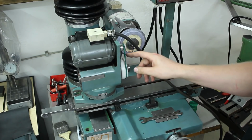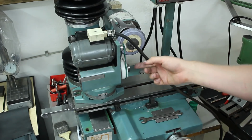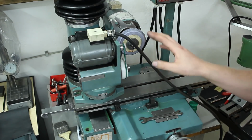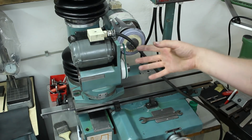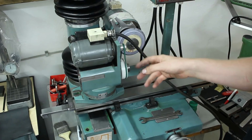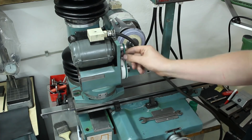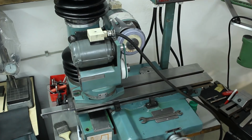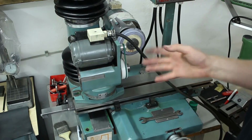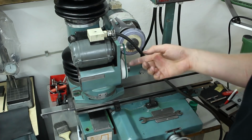Originally there was a set of gears going from the motor to the spindle, and I did not like that. It was relatively noisy, and you could see it on the surface finish of the grind. So I took off all the gears, machined 2 pulleys, and welded some 4mm polyurethane belting into an endless loop. And now when I let this run, it's really very quiet. Yes, the belt cover is off, it's sitting over on the bench.